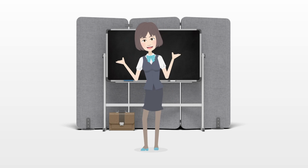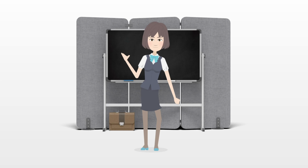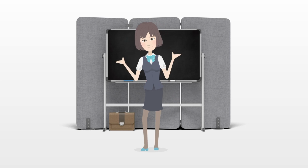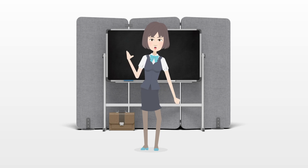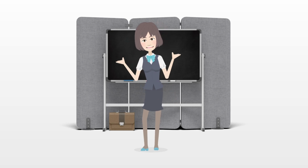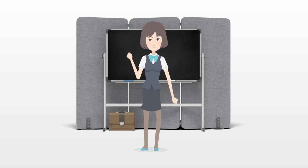When hanging the acoustical panel on your wall, make sure you are using strong hooks or reinforcing screws with drywall anchors, otherwise, after hanging your panels, the screws will rip right out of your wall. Not comfortable using fiberglass insulation? Try foam or shredded paper instead.